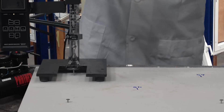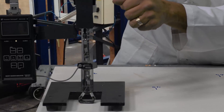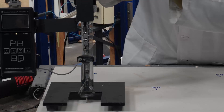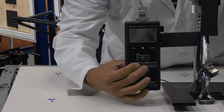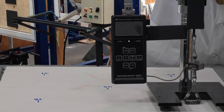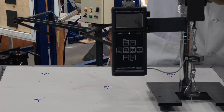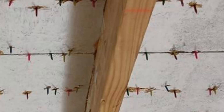With every roof that is torn off, the rows of nail lines are increasingly populated with prior nail holes and the risk increases that you will have shingles that are more easily blown off. At four nails per shingle, it has been calculated that on the very first re-roof as much as 10% of all the nails driven into the shingles would be driven within a half inch of a prior nail hole.